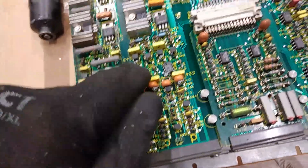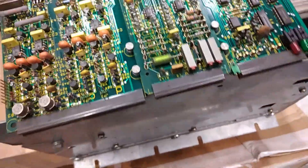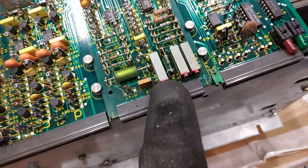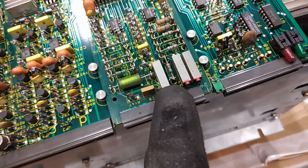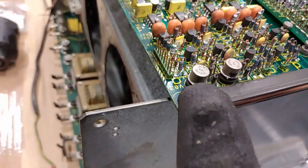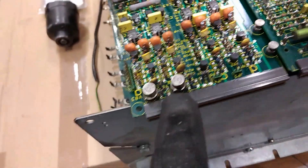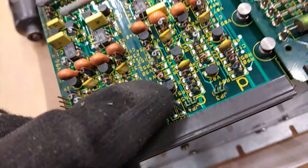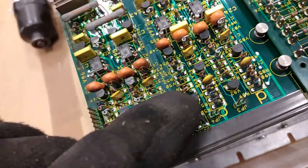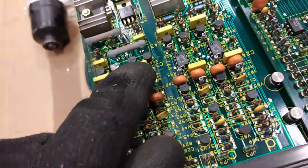Of course, a lot of small ICs on the side. And what we have next — these gray squares are potentiometers. They sometimes contain small amounts of silver and palladium. Look at that transistor — a three-leg transistor. Sometimes it has a gold bottom with gold-plated legs, sometimes not. This plastic three-side-leg transistor contains some small gold bonding wire, and sometimes contains gold-plated legs. This yellow one is just worthless.